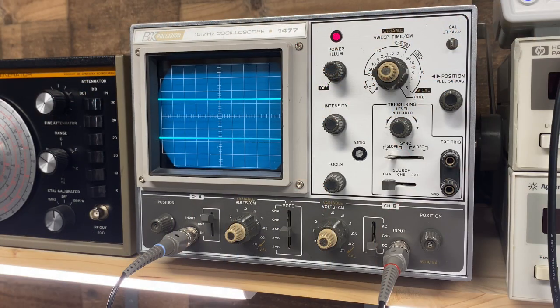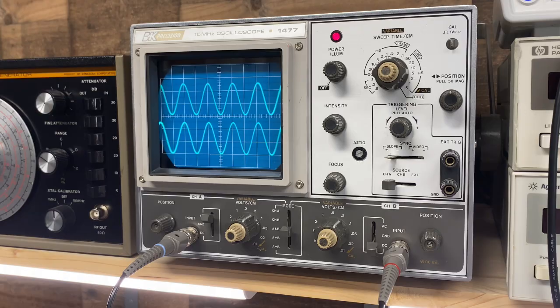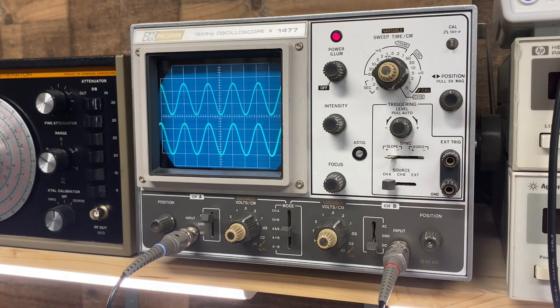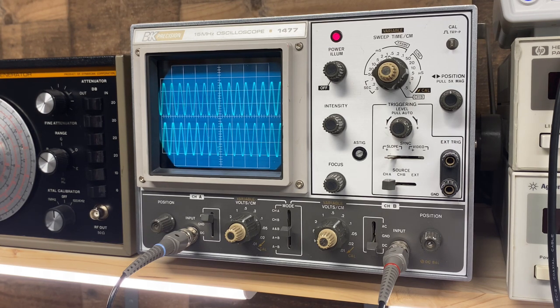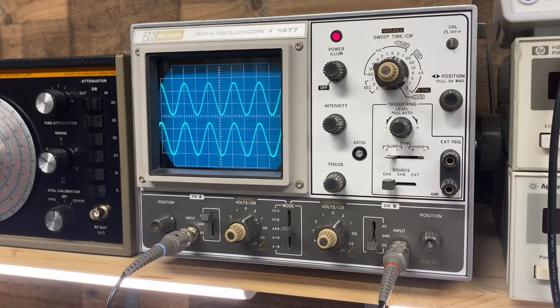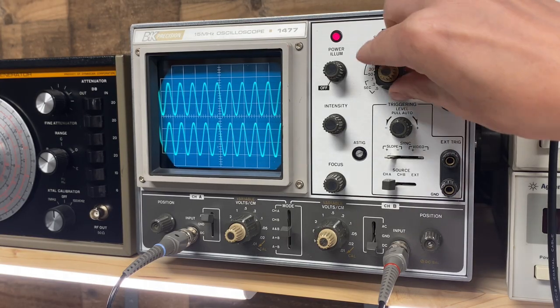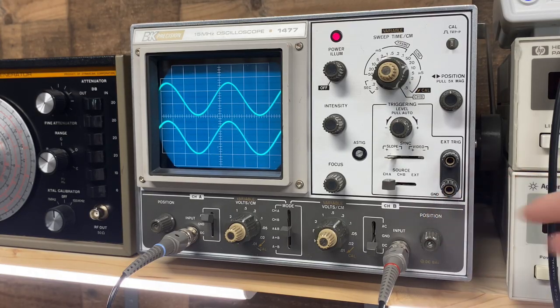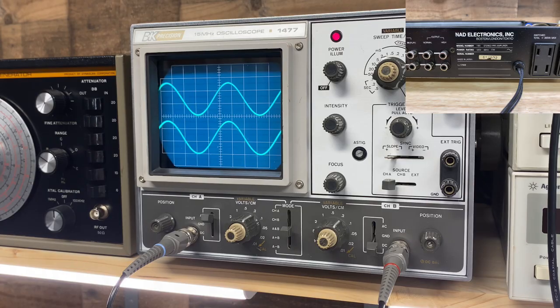Final test. I have a 1 kHz sine wave at the CD video input. Both channels look great - they look to be evenly matched. And if I turn on and off that listen switch, nice clean transitions, and even when I toggle it, it doesn't drop out at all. So that's pretty stable now. Let's increase the frequency and monitor the response. There's 5 kHz, still looks good, 10, 15, and 20 kHz - looks good to me. So this preamp just needed a little bit of love and I think it's ready to run for many years to come. Thanks for watching, we'll see you next time.